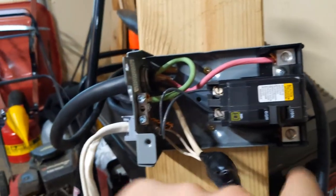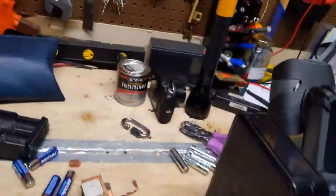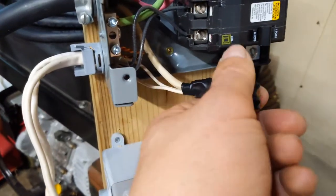So you have one side of the 240 volt, which is 120 volt, coming in here and leaving down through here; the other side comes in here and out through there. The neutral is tied together, and the way I did this is I took a split bolt connector — I actually have one over here on the workbench I can show you. It's a little connector where you put the wires in and tighten the nut down to close them in. You torque these to about 80 inch pounds.